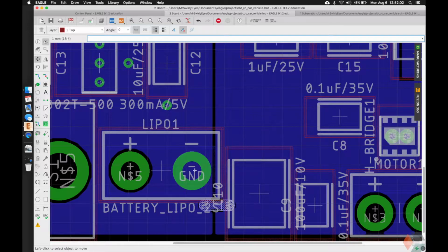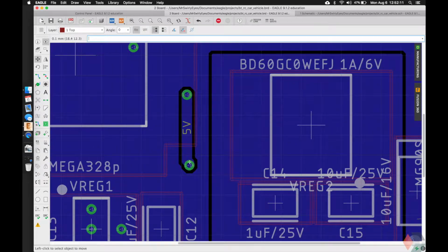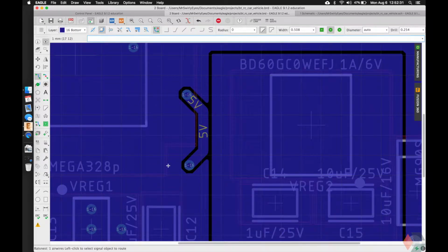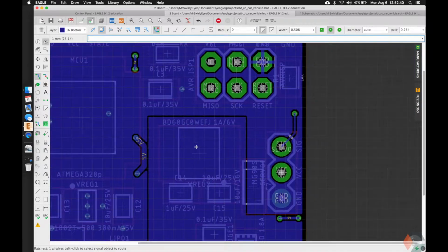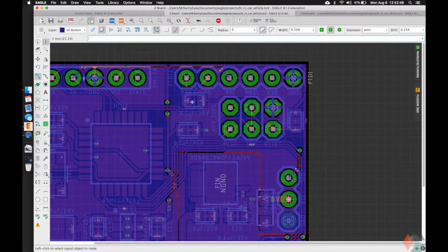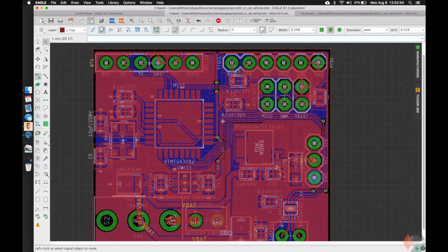So our reference voltage will appear to be as close to our battery reference as possible. We brought this back a little bit. We can rewire it on the bottom if we choose. There we are. So we kind of keep the continuity as much as possible. We can even massage it on the top and put the vias in a better spot. Anything else standing out? This can't really help it. Maybe we could have pushed it back and then routed the top in and out here, but again, that's fine. It really depends how meticulous you want to be and how much you want to save.